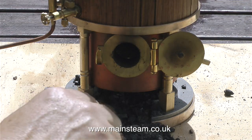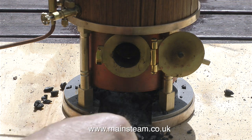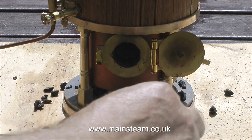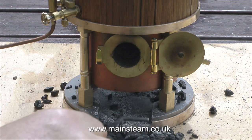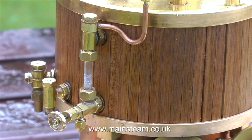This of course is the downside to coal firing — you have to do this. It's far easier on a boiler this size than it is on a full-size steam locomotive. I've done a little bit of that and I was horrified when the smokebox door was opened after a day's running and the smokebox was half full with ash, which all had to be shoveled out. Now the boiler's fully blown down, you can see the residue in the gauge glass — this will need cleaning out too. This has been a very successful steam test with no problems at all. This boiler is very good.